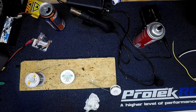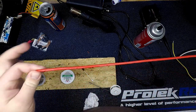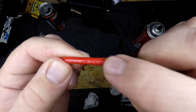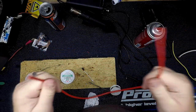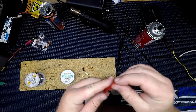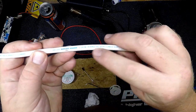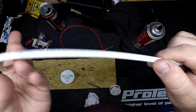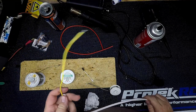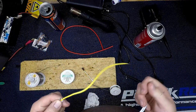The third thing is premium wire — not necessarily premium, but wire rated correctly for soldering. This silicone wire is the highest grade you can get, rated at 200 degrees Celsius on the jacket, meaning it will withstand 200°C before it starts to degrade. I also have this marine grade boat wire I use all the time — it solders very well and has a rating of 105 degrees Celsius. You want a wire that's at least about 100°C rated to handle the heat of soldering without the jacket melting.